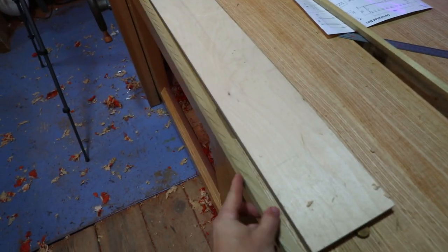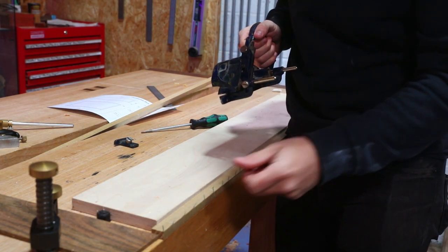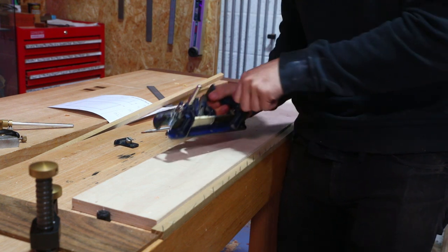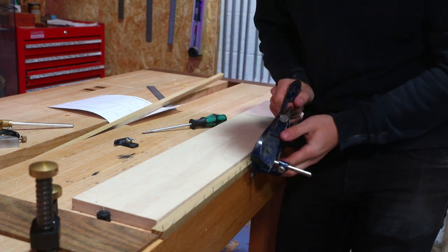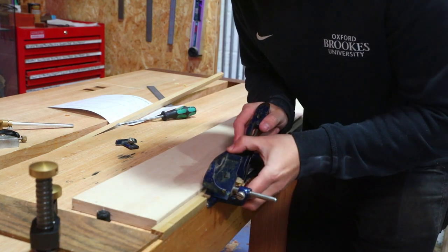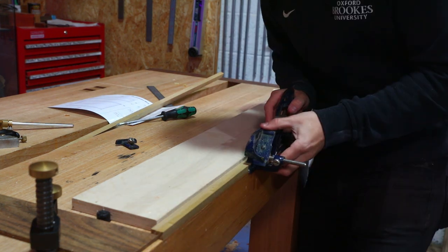The plywood is locked down, and the plinth is restricted by the backstop. Even though the plywood is sitting higher than the plinth on one side, as long as nothing is sticking out the side of the rebate plane, you're fine — just adjust that bar so the entire side is flat. Now we can begin rebating. Same as before: start at the very end of the cut and then gradually bring it back until you get a full-length shaving. This prevents the plane from tracking the grain on the first pass. Patience is key.